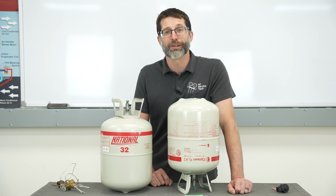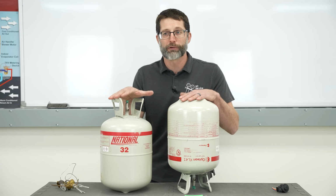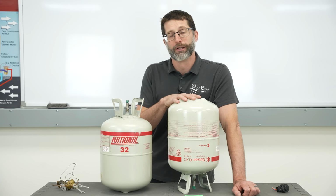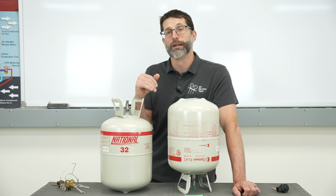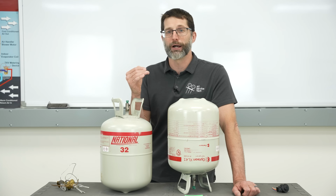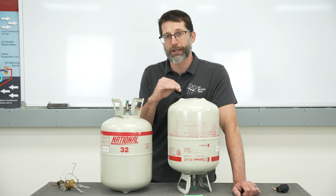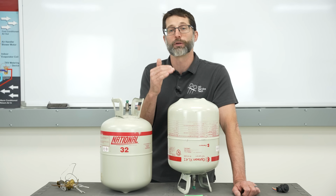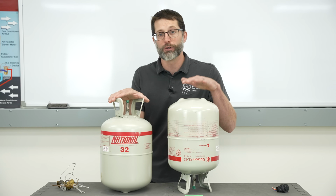So I hope this video helped, and I hope this kind of cleared up some of the charging methods that we might use with these new A2L refrigerants. And you're going to want to stay tuned for any updated procedures with these new refrigerants. So there's a lot of updates with these, so you want to be aware of those. I know the EPA presently is determining if we do need an A2L certification for working with these refrigerants, but presently you're just following the EPA 608 and you're doing voluntary, maybe certification through something like ESCO Institute with their A2L course. But otherwise, that's how you check the refrigerant charge using the subcooling method for A2L refrigerants, R-32 and R-454B.